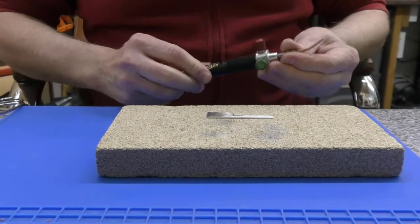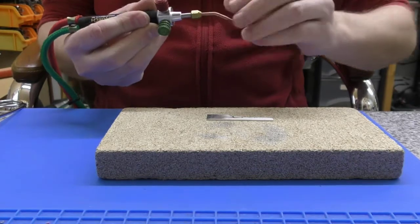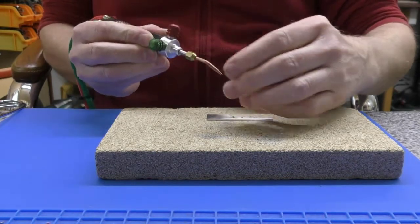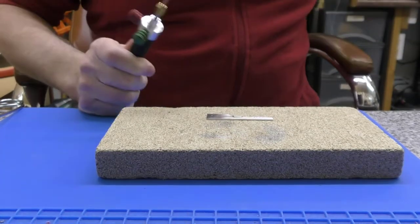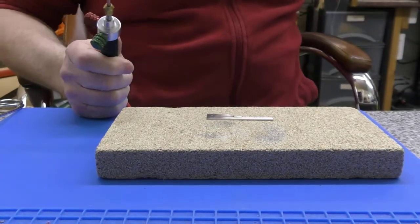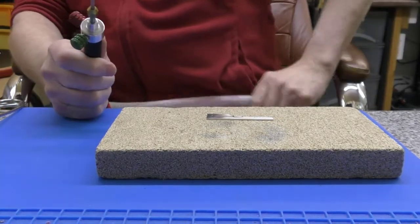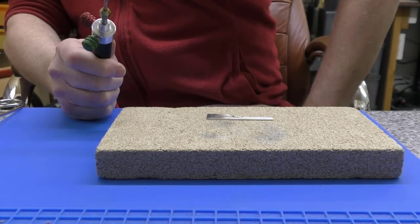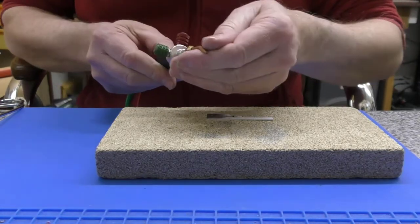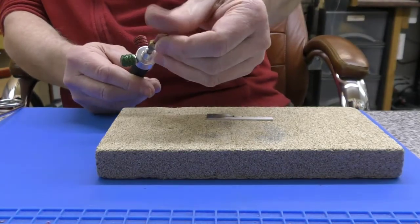Okay, so we've finally got some time to have a look at the oxyacetylene torch. I'm just going to get that into the right position. So we have checked for leaks, we've got everything fired up. We only need 2 psi for the oxygen and 2 psi for the gas on this number 2 nozzle, which is the finest one the kit comes with.